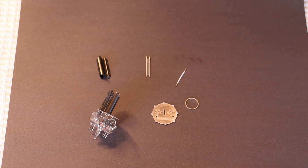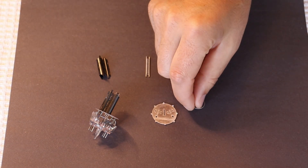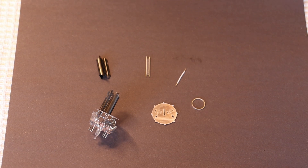You don't want gas in your tube, but you always inevitably end up with some particles floating around in there. That's the purpose of the getter. Here's the getter ring from a 7F7 tube that we've removed. This contains a gas-absorbing metal that gets flashed off and is designed to absorb those particles. But you can't do that if the particles aren't heated up and floating around inside the partial vacuum. If you let a tube sit for too long, any gas particles in there will settle on the different components, including the cathode, and cause small imperfections in the surface that need to get burned off with time. That can cause a little bit of noise or a loss in performance, and just running them for a while after they've been sitting for 60 to 80 years gets them back up and working correctly.